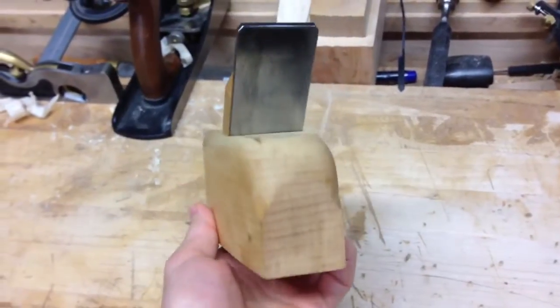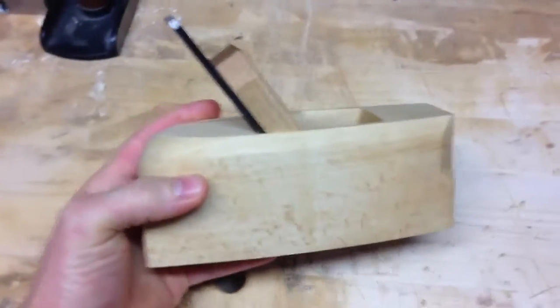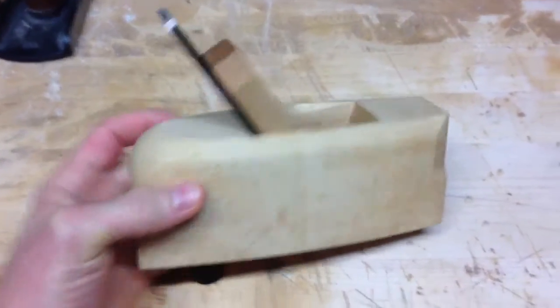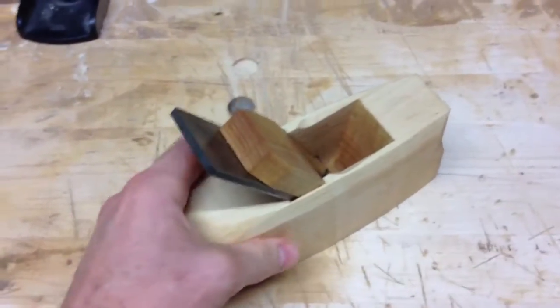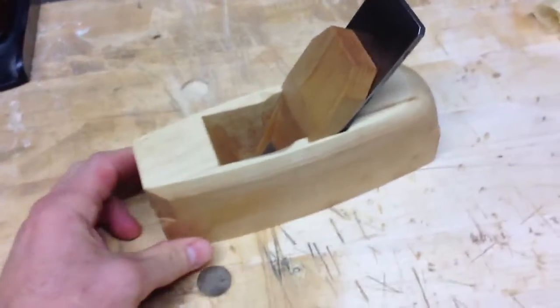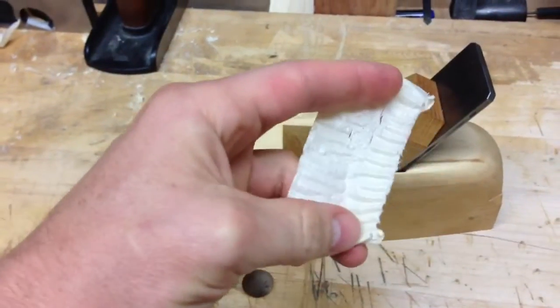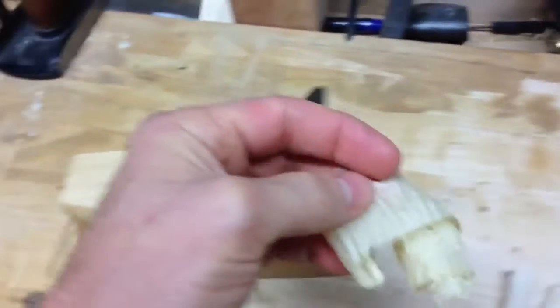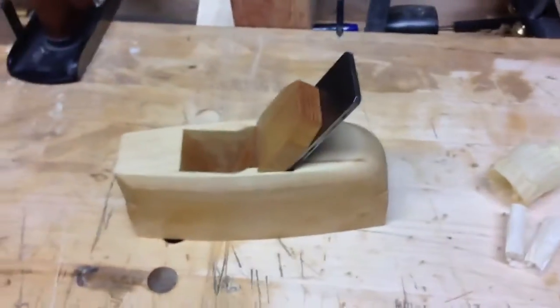It's got some nice little detailings, and I am really enjoying using this plane. It just seems to be the perfect size for getting into some of those localized areas where you want to do some cleanup, but you don't want to be worrying about working a large area just to get that one small spot. It's bedded at 55 degrees, so it takes a real nice clean cut. Here's some shavings from hard maple, and then some yellow pine. You can see it takes a nice full width shaving — good clean shavings — and it works great in hardwood or softwood.